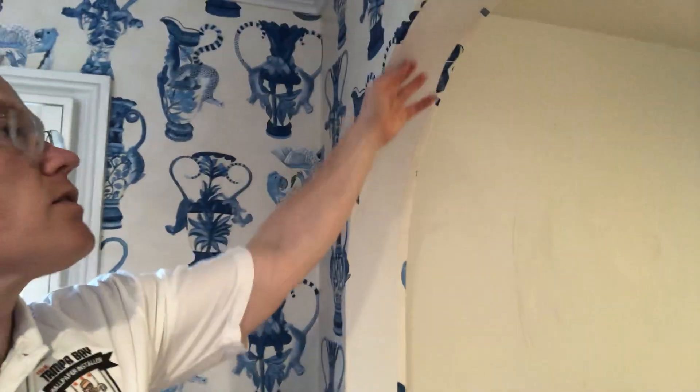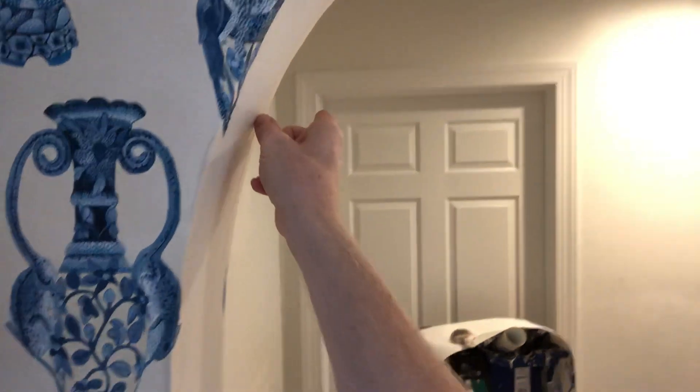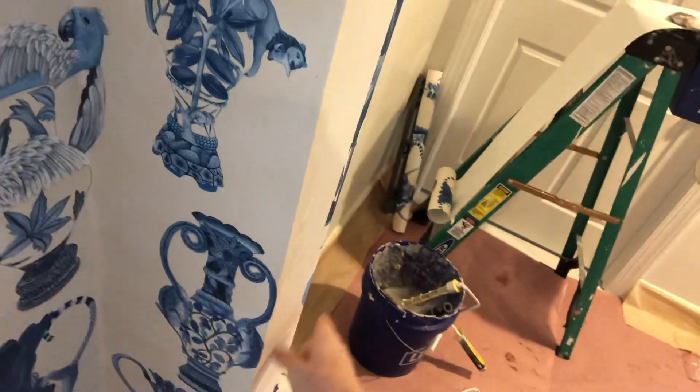Same thing over here. You're going to clip just around. The best way to do it — if I do it from this side, with my paper hanging over, picture the paper hanging over, I just hung it — from this side you're not going to overcut it. You just use your knife. See what I'm doing with my thumb? I just hold the knife with my thumb up against the wall, and it protects it from cutting too much.